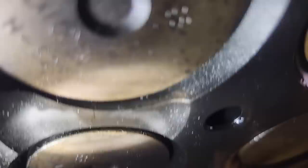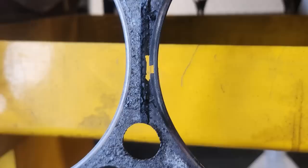It's a small crack, but it's there. Four is also cracked — similar, it's kind of small. And then five, being where it was locked up, you can really see the crack there. The customer opted to go with a new aftermarket head. I believe the big problem here is the head gasket, not necessarily the cracked head, because cracked heads between the valves on C15s are actually quite common and don't always cause a problem. But this head gasket being blown does cause a problem.